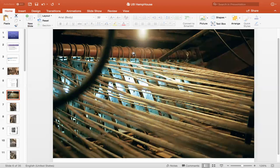Sure. Well, I think the advantage with this U-bolt and pipe assembly is, you know, if you've got a bunch of head blocks, and as you mentioned earlier, the tendency is to move them around because you want to maintain that flexibility. If that's a piece of wood that they're lag bolting in, after a while, it starts looking like Swiss cheese. It gets all perforated from the various locations of the head blocks. And either the wood is going to just let go, or you're going to pull a lag bolt out of a soft piece where you were kind of near or next to a previous lag bolt hole.